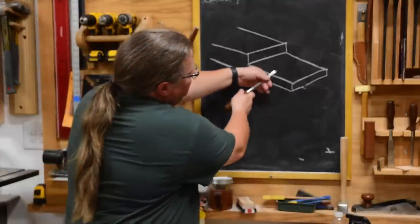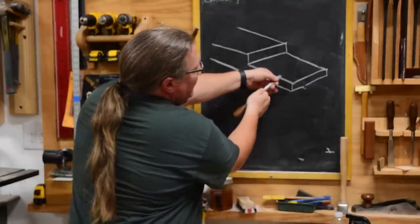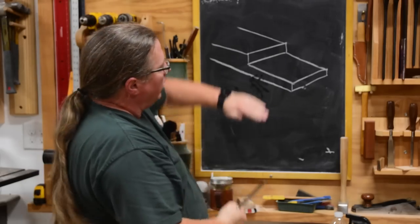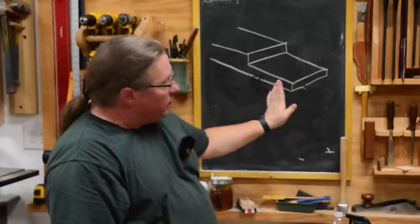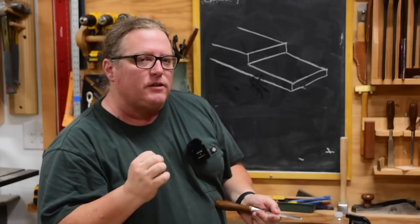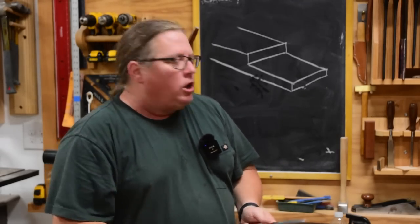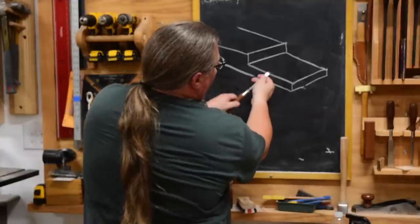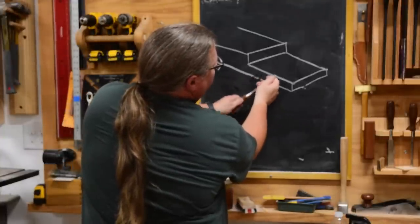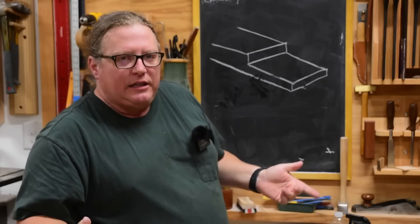Well, here's another option. If you were to take your hand and position it, you can kind of start at whatever low point is and flatten it out there and just arc it down. And if you arc it one way, you're going with the grain going up this way. If you arc it the other way, you're going with this way. So you can actually use a chisel with the grain to get a good surface, which will give you an even better bond. But more importantly, it kind of slows the process down and gives you more control. So instead of coming straight across the thing, I'm kind of arcing a corner until I can create a huge swath like that and make life a lot easier for myself.